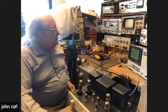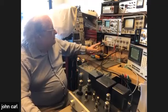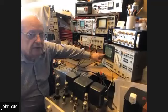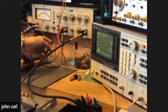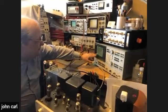I'm going to turn on this little amplifier. It's been off, and it takes about a minute to warm up. I want to show you the screens that I have here. This screen here is only showing me the residual hum in the room, on the cords and cables that are not doing anything. They're just sitting in free space. Kind of like if you unhooked a connector and you heard some buzz or hum. That's basically what we're seeing there. And that's all concentrated in one little corner, which is below 1,000 cycles.